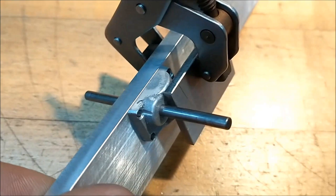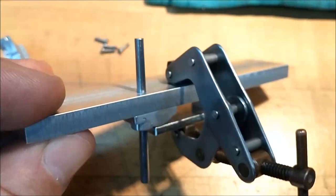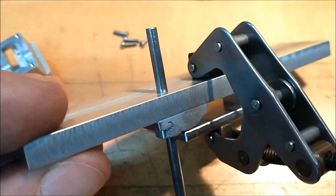The plan is to align the part true with this piece of scrap aluminum, drill and ream a hole through for alignment purposes, and it's set up. Invert the whole fixture and come through from the back. Put the counterbore straight through the fixture, straight through into the part and out. Well, not out the other side, but the fixture. Let's take it out of the machine.